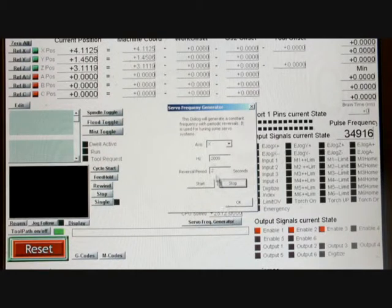If we stop that and change to 5,000 steps and run that — she seems a lot quieter and happier at 5,000 steps than at 2,000 and 1,000. I think this is just setting up parameters. The initial noise when I started on 5,000 steps was that the carriage actually hit the end stop, and the motor was jumping because it couldn't move any further. So it's not really at its lower speed.